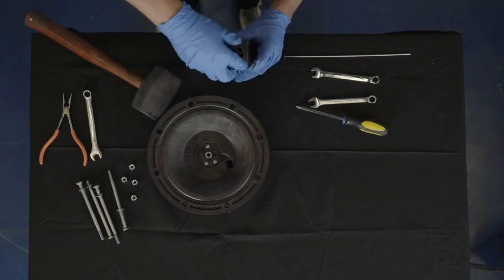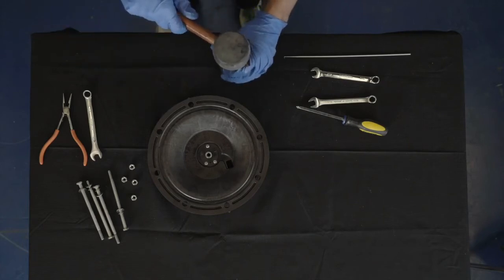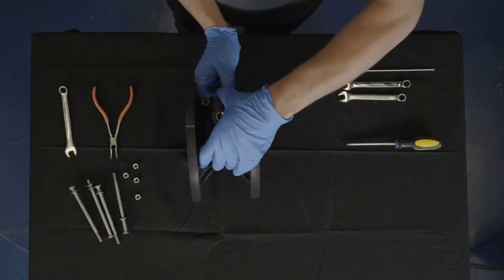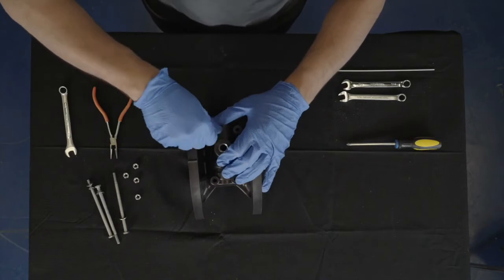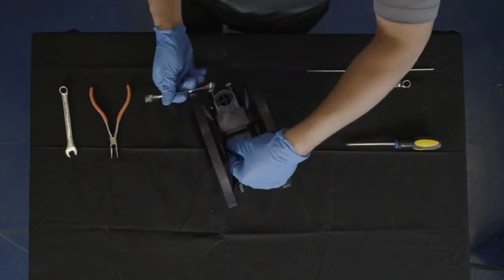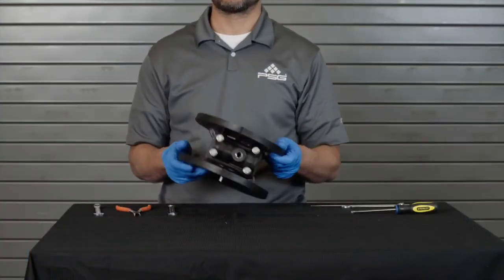Lubrication of the air valve assembly with a non-synthetic lubricant is recommended. MagnaLube or MagnaPlate are recommended for assembly lubrication. Note that if the lip seals are installed incorrectly, they will not be able to rotate. When inserting the air valve spool, insert the larger chamfer side first, as the air valve spool's longer piston is to be on the plug side. Ensure the O-ring is installed and then place the air valve end plug into position.